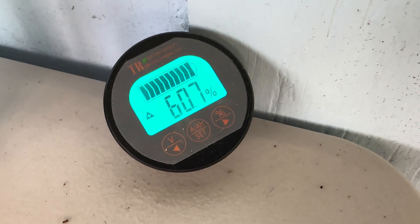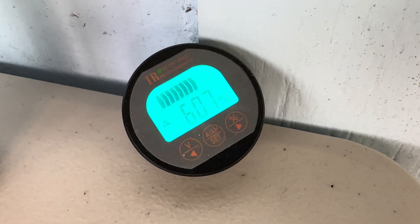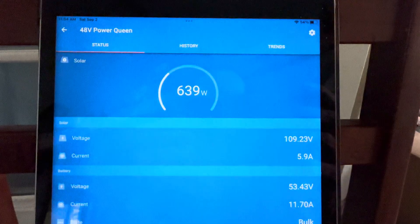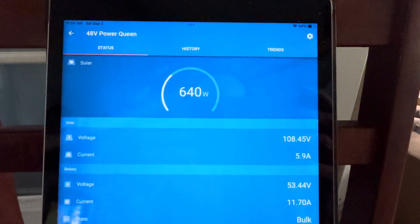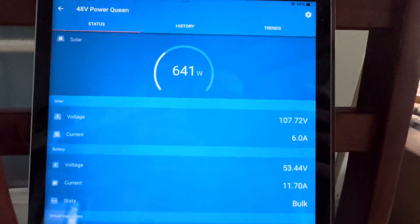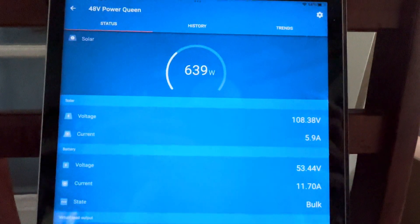Now that I've been running the 48-volt system for the past couple of days — giving that Chins battery pack a chance to get up to full — you can see I'm charging and running the entire household at 60%. Typically this 48-volt is usually pretty full, but I've been draining it a little while running everything. It keeps up quite nicely. Taking a quick peek at what's coming in for that 48-volt battery: 700 watts worth of panels, and right now catching a nice sunburst — 640 watts going in, well exceeding what the household is drawing at the moment. So that battery, while running the entire house, is actually being charged — which is exactly the way I like to build my systems.